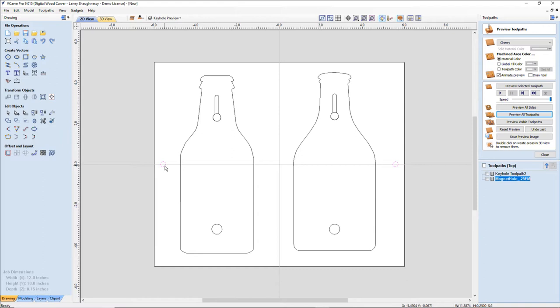And then in my waste board, when I move this board out of the way, I'm going to run my waste board cut. I'm going to zero out on the top of my waste board, and I'm going to cut my 3/8 inch holes in there. And what that does is, if it's late at night or something, if I create it this way, I can run that keyhole path that I'm going to cut at any time. I can shut down my machine that night, go tomorrow, what have you, and I can return. I don't have to do it all in one operation. Okay? So, with it being so late, if I were going to cut these out tonight, I would do it this way. So, that's how I'm going to show you.